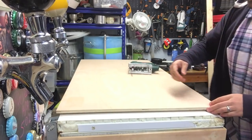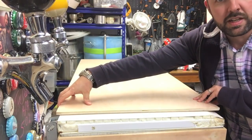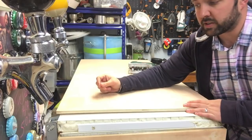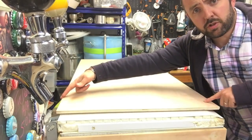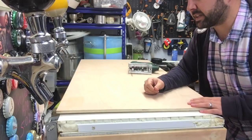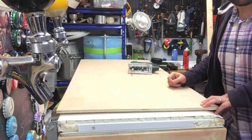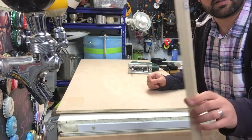So we got that off and the next bit is to basically cut this plywood top down a little bit. Across here it's pretty much the right length but it's a little bit too long. This is a standard size plywood sheet from DIY shops — I think it's 610mm or 607mm across and then 1200mm the other way, so about 1.2m by 60-ish. I need it cut down to just over a meter on the length, and then we can do the edging or skirt on it with this 22 by 47mm strip wood.